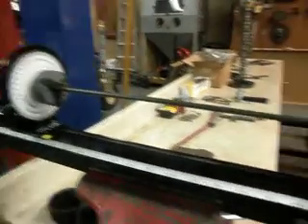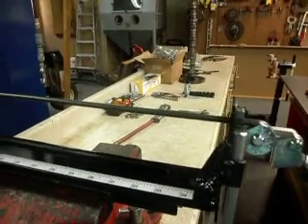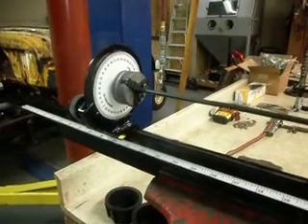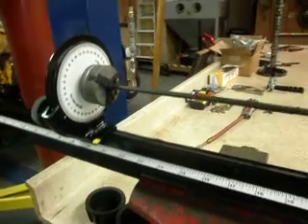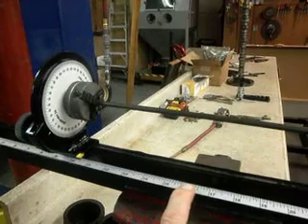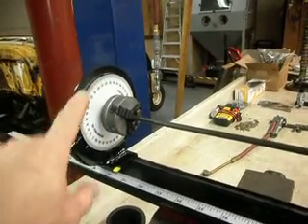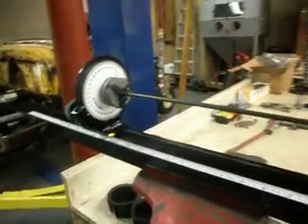So how this thing works: over here is your typical bending tool, which gives you your degrees of bend into the tubing. To get the tubes bent consistently every time, there are two other measurements you need as you go through your bending process. One is to slide along the rule a certain distance out before making the next bend, and the other is to index it to the next degree off of where the last bend was to where the next bend needs to go.